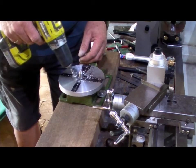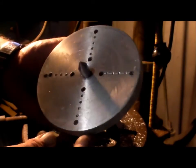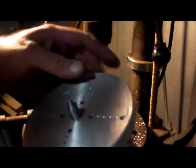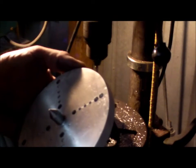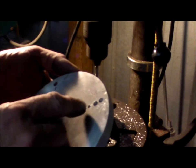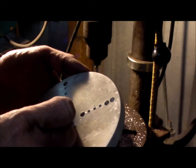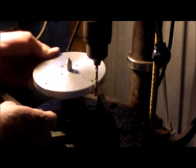I'll just spot these center punch marks with a 3mm bit so I can see what I'm doing in the drill press. I've drilled the outside four and the inner four holes at 6mm — these are going to be 6mm slots. I mistakenly started to continue drilling with a 6mm drill, but I'm going to change that to a 5.5mm, because if there are any slightly incorrect punch marks along the line, I can correct it by leaving a little bit of material and filing it back. So we'll see how we go with the 5.5mm drill bit.